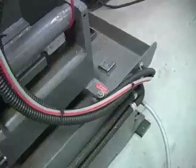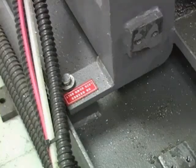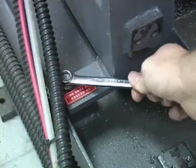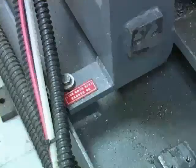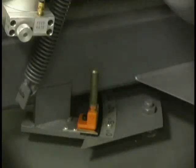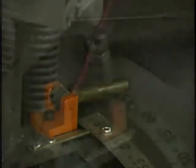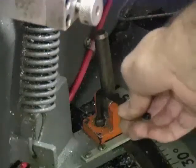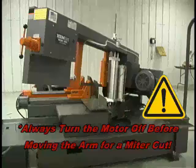There are two lockdown bolts at the pivot end of the saw. These bolts can be tightened when 90-degree cuts are going to be made, providing more stability to the arm on a mitering pivot saw. They are loosened to allow the arm to swing to the desired angle when making a miter cut. To swing the arm over for a miter cut, first be sure the arm is raised enough for the blade to clear the cut slot. If the 90-degree lockdown bolts are tightened, loosen them before attempting to rotate the arm. Loosen the cam lock handle and rotate the arm until the pointer aligns with the desired angle on the protractor scale. Lock the cam lock lever down before cutting. If the cam lock lever is too tight or too loose, it can be adjusted using the allen head bolt located in the cam lock lever mount. Always turn the motor off before moving the arm for a miter cut.